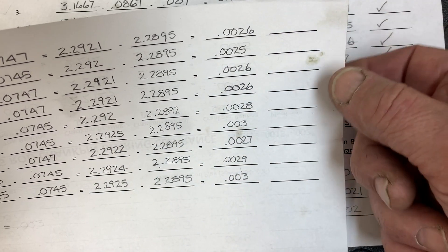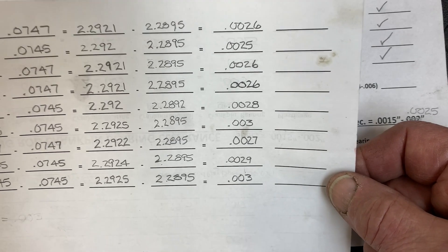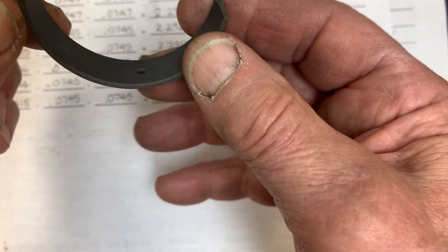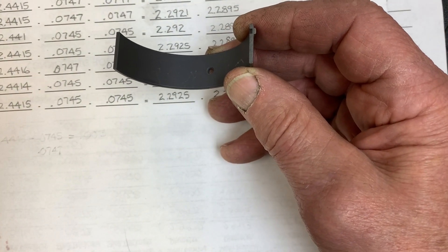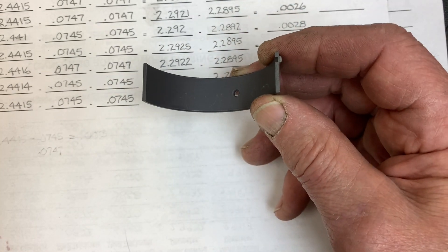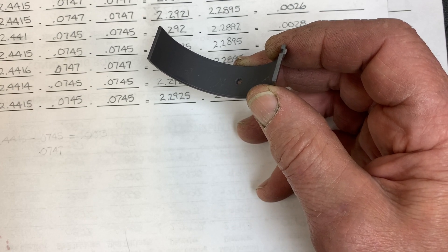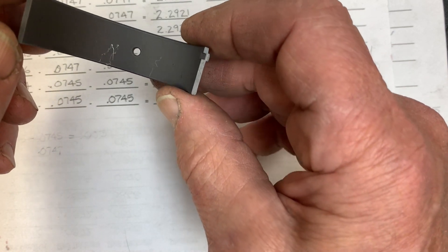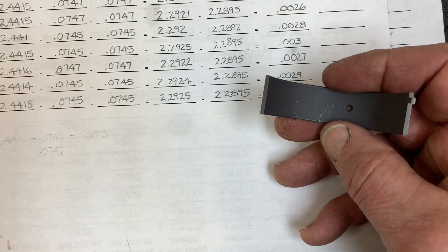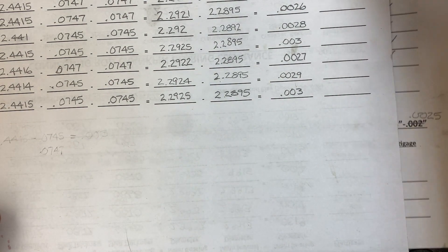These would be acceptable under normal circumstances, but we've got some of them that are only four ten-thousandths of an inch away from being too big. So what I chose to do is take dry film lubricant and coat the bearings. This film thickness should be about five to ten ten-thousandths of an inch, but I didn't need that much, so I shot a light coat — I've got about two to three ten-thousandths of an inch. Now you see there are some scratches on there — that's just burnishing of the material that occurred when I was measuring the bearings. What I came up with was a thickness generally between two and three ten-thousandths, and that was exactly what I needed.